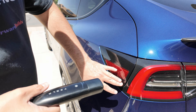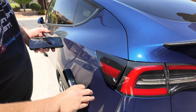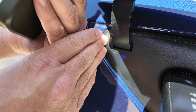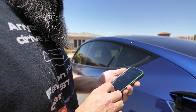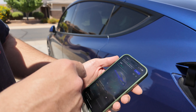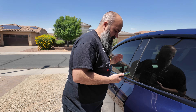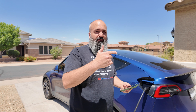Do you have to unlock the car? I don't know — go into the car, pop the door open. There it is. Plug it in. It's blinking — I just heard that thing click inside. That says we're charging. We should probably put the charge limit at 80. It says six hours and 30 minutes remaining. We currently have 17 of 40 amps going in — I'm guessing it's going to ramp up. Now it says four hours, 32 amps, seven kilowatts, then 40 amps — nine kilowatts going in, four hours and 35 minutes. I'm charging during the daytime because it's the weekend and my power costs the same through the weekend. Typically I would charge at night.